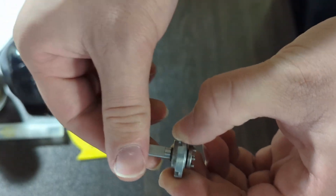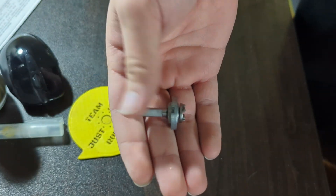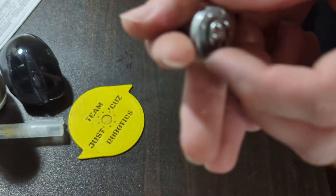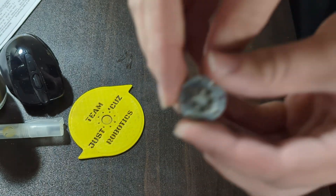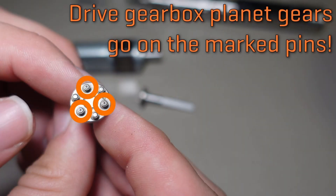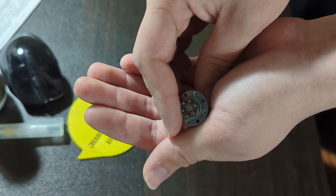This is now assembled and has almost no play and spins nice and freely. Now you would just reassemble the same way as with the previous drive shafts. The shaft, just like the replacement shaft, has nubbed pins and non-nubbed pins. For this drive gearbox you're putting gears on the nubbed pins, but check the other video for reference to see which three pins the planet gears go on.